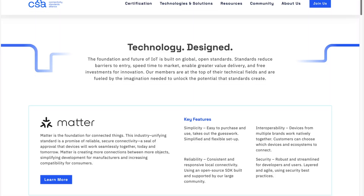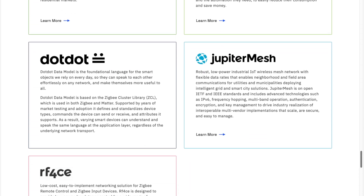Before we dive into the installation, let's talk about Matter, because this device is Matter enabled. Matter is a universal standard for smart home devices created by the Connectivity Standards Alliance. The idea is simple: instead of juggling a dozen apps and integrations, Matter is a universal protocol that allows you to register any Matter device directly to platforms like Apple HomeKit, Google Assistant, Alexa, or Home Assistant. It's not a new communication protocol, so it doesn't replace ZigBee or Z-Wave. Think of it as a layer on top — it uses the existing protocols: Wi-Fi, Thread, ZigBee, or Z-Wave, and handles the registration and communication.